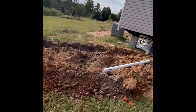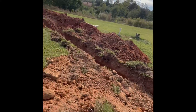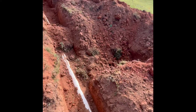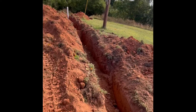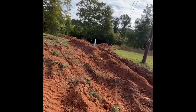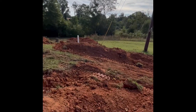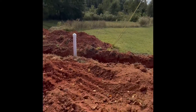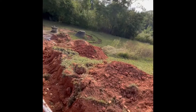This is a very long trench — over a hundred feet from the house to the septic. When you have a trench or fall underneath the house, you've got to have one inch of fall for every four feet of pipe. That ensures the sewage and water and everything you're flushing down the system falls correctly.